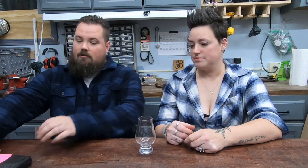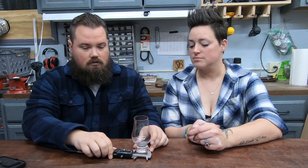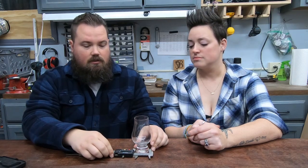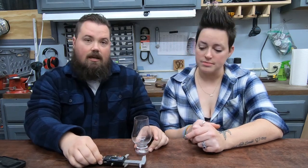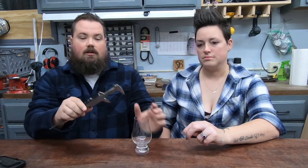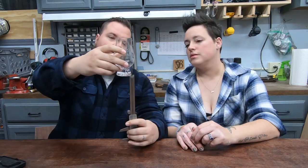I've got my calipers right here. Really what I want to do is make sure the hole is big enough for the bottom to fit, and the biggest point of that is right about 47mm, so I'm going to jump up to 48 millimeters and we'll see how that goes when cutting it. Right about here we're looking at around 30 millimeters, so as long as we go above that depth they'll be able to sit down in. We're going to use the same program we used last week — boxes.py.